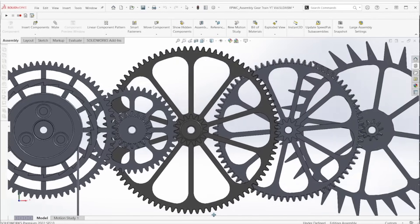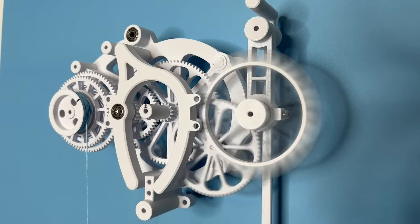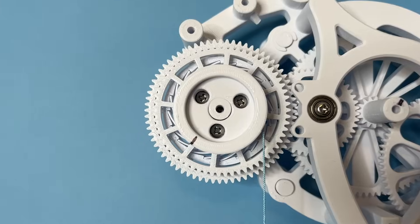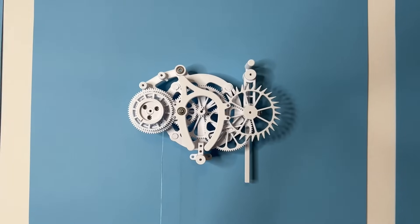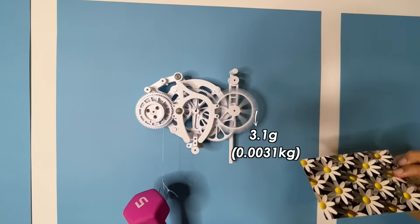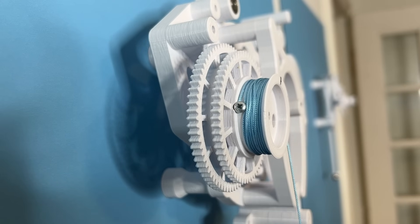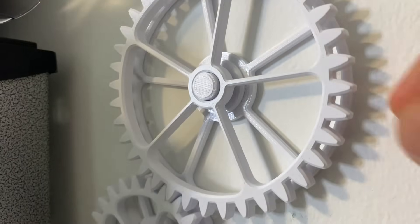For the gear ratios required to run this clock so long, we need precision and strength in the gear trains. If I pull the hour wheel through one full rotation, you can see how fast the escapement wheel — which is also the seconds hand — spins. That's 12 full hours of a clock running, or 43,200 seconds. The total gear ratio from the hour hand to the seconds hand is 1-to-720. We need a good amount of weight, because when you increase speed by 720, torque reduces by 720. The 2.25 kilogram weight at the hour wheel reduces to just 3.1 grams of force at the escapement wheel — which is why I can stop the escapement wheel with a piece of paper. Too much friction, and there won't be enough force to keep the pendulum swinging. This is why gear mounting is such an important consideration — I couldn't get away with fully 3D printed shafts, as there's too much clearance required.